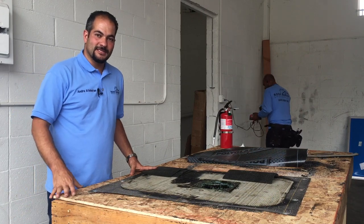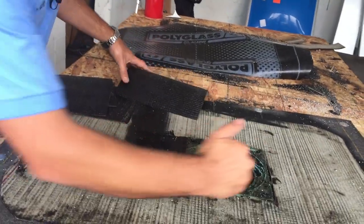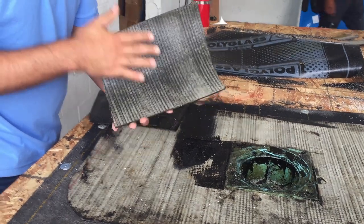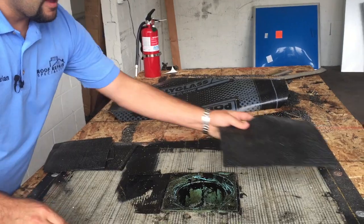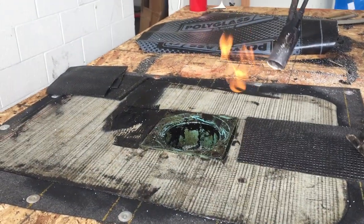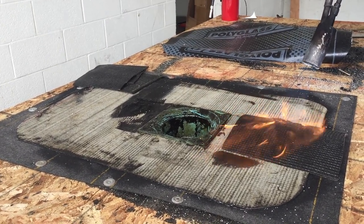For the next step, we're going to use some smooth to fill in the gap between the cast iron drain and our new smooth membrane. You can see here we've got some gaps all around. What we're going to do is take any piece of either torch down — granulated or smooth — use the back side, melt it off, and Jose is going to demonstrate scraping that onto the gap. We call it by the slang name 'milk,' or it's the bitumen surface — it's a hot asphalt. He's heating it up, getting it melting hot.